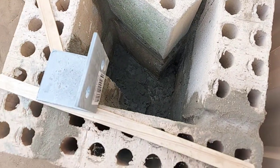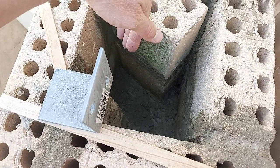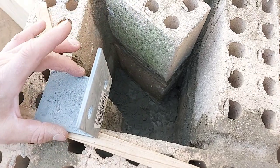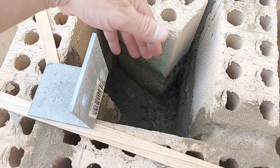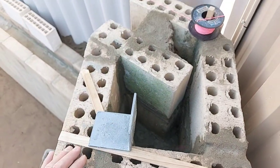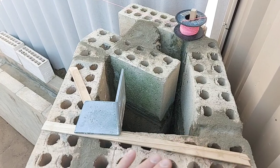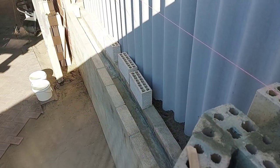I have to put a soft mix in here but a bit of hard mix around the actual stirrup itself to make that really strong — I had to bond that in place. After that I put rubble and then a really soft mix because of expansion and contraction. We don't want cracks to form and problems to occur.